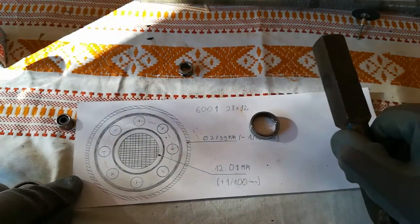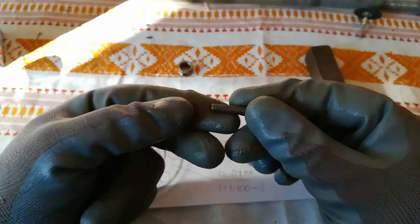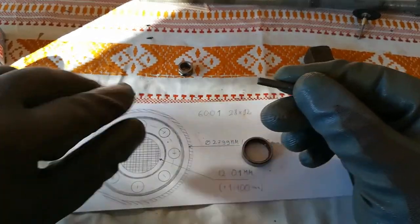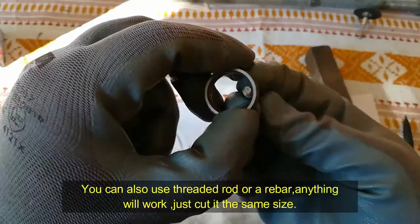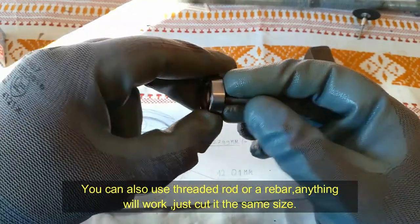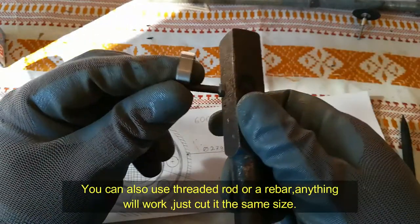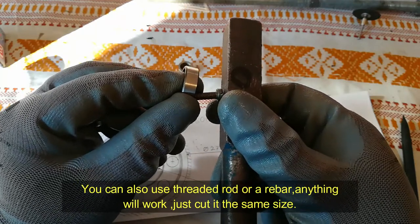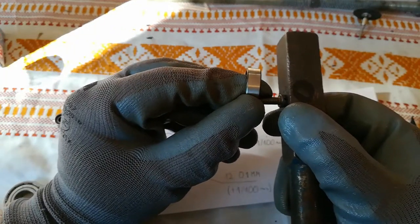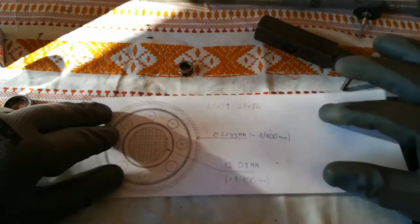To connect this to the outer race, use a simple machine screw, use the file, cut it a little bit and weld it to the bearing — to the race. Once it's welded, you will have two of those. You can weld it to this rod and as you push that weight, it's going to pull out the race. This worked for me in the past — I hope it will work for you too.